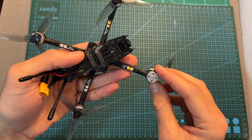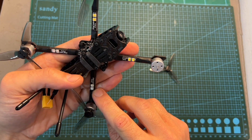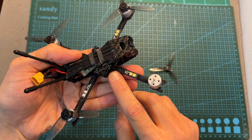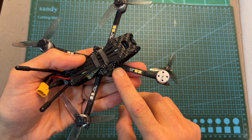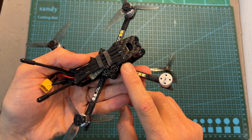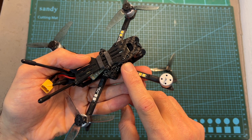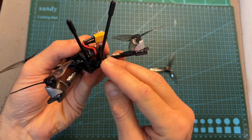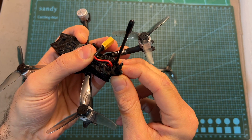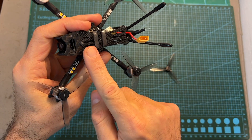The motors are connected using race wires to the all-in-one flight controller. On each arm you can find two LEDs, and at the center of the quadcopter you can find an all-in-one F4 flight controller featuring an integrated 15-ampere BLHeli_S 4-in-1 ESC. Above it you can find a 40-channel VTX that supports TBS Smart Audio protocol and has a maximum output power of 200mW. On the back of the frame there is a linear antenna connected to the VTX and secured using a 3D printed TPU part. It uses an XT30 battery connector and the battery is mounted on the top plate.